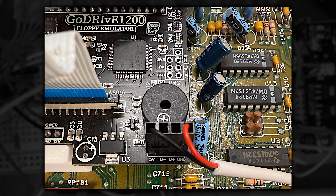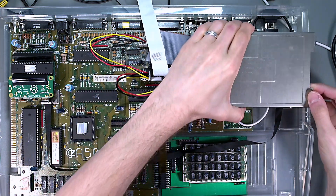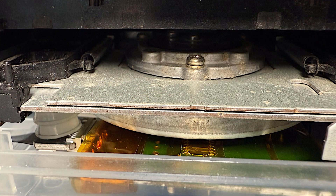And no, I didn't get the wires the wrong way around — this happens to be one of those strange cables where the red wire is ground and the black is 5 volts. This leaves the job of just putting everything back together, and whilst it looks like a tight fit, there's actually plenty of clearance and it's neatly hidden away, making it seem more like a sneaky magic trick. So that's how it fits into the case, but we haven't seen it working yet, and aside from that we haven't seen how well it performs. Does it introduce any lag into the picture, which would be really annoying when playing games or controlling the mouse? And does the audio come out in sync with the video, or does it get lagged by the conversion and injection process?